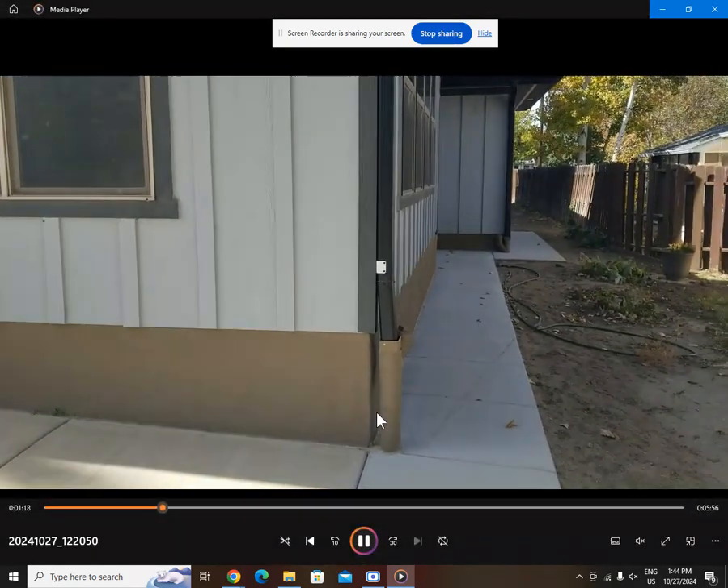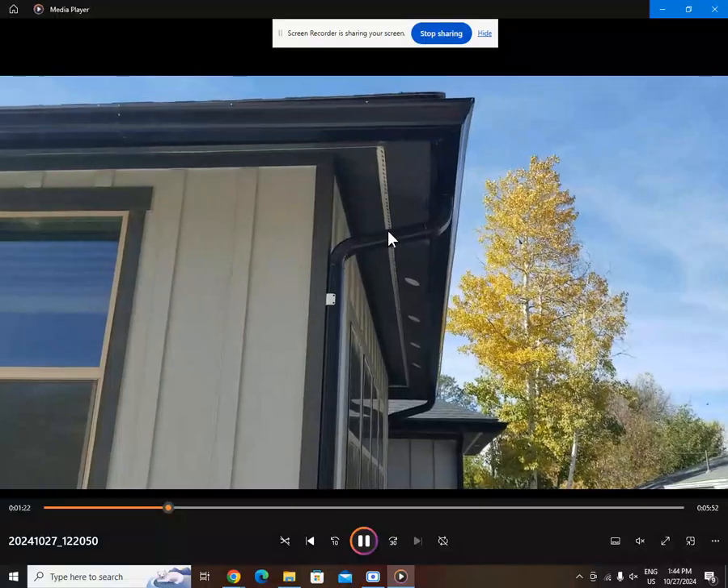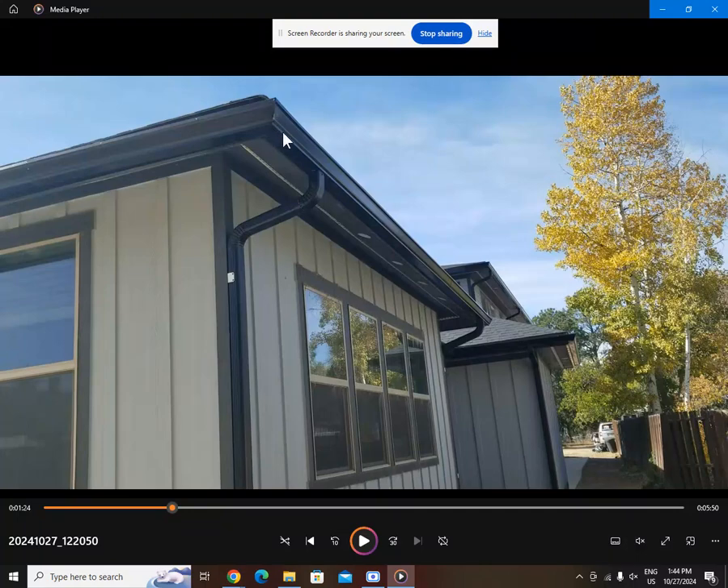My corners here — that's a great mitered corner. I want you to go down the rabbit hole on rain gutters. If you're watching this video and made it this far, I'll tell you whose channel to check out: it's Mark Corvelli, Rain Gutter University dot com. He'll show you how to make the miters. I kind of wish I would have cut my rain gutters with my miter saw — turn them upside down, put it on a 45 and cut them. I did it with tin snips which is murder on your hands. If you have a 12-inch compound sliding miter saw, get the metal cutting blade and use the miter saw.